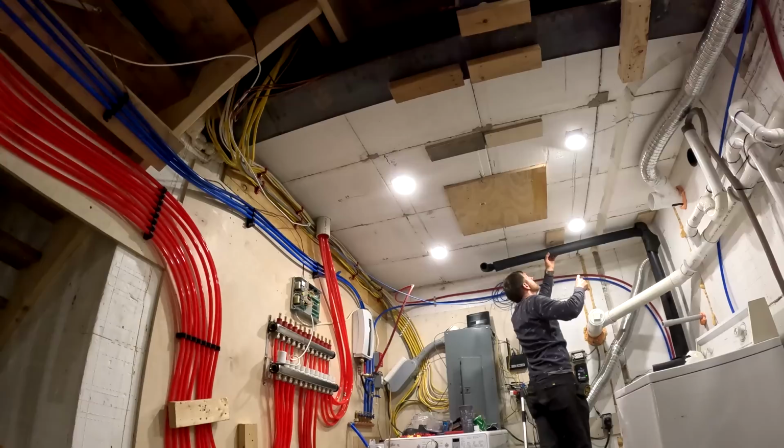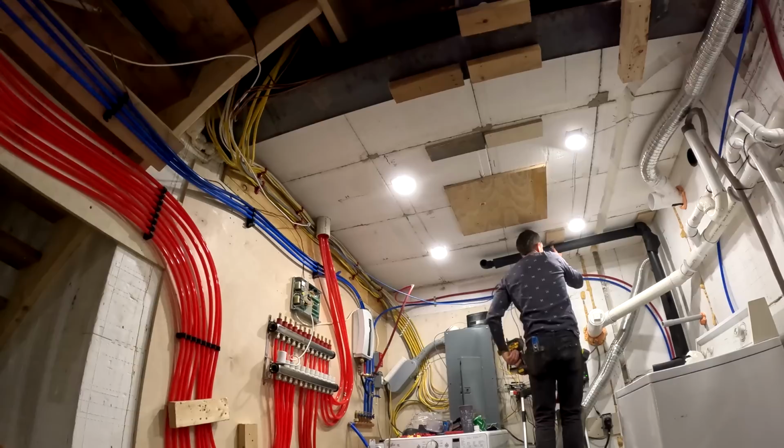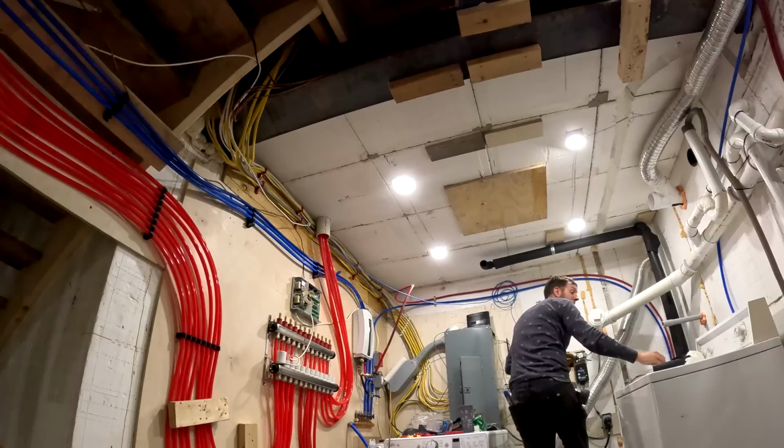I figured though with the fan coil it wouldn't hurt to be oversized with it, because it's not like it's turning on a compressor every time, you know. Yeah. True, short cycling and stuff. Well, the only thing it's doing is turning on a circulator pump. That's it. That's what's nice about those. They're oversized, but I don't think it really matters at all. No, it doesn't. Never freezing anything out.